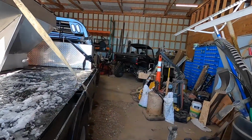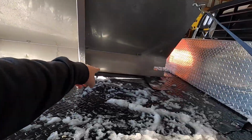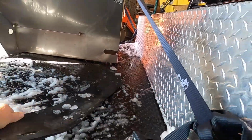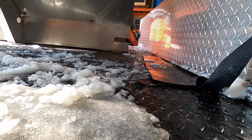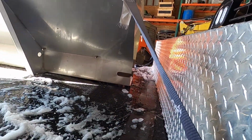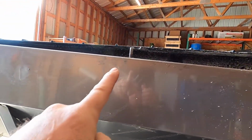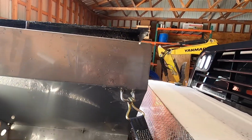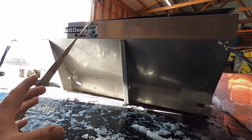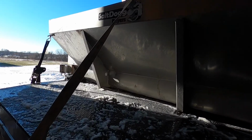And then it's still not over. See how everything's touching here on the ground, touching. Well, I can pull this out. Not touching. It's about half or three quarters of an inch up here on the corner, and the other side is touching. So it's got a pretty good twist in it. Besides, see how far off we are there, and the grate's definitely not going in. It's racked. Instead of being like that, it's like that. So we have to fix that.